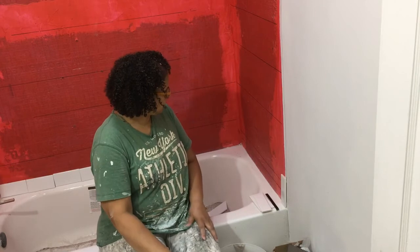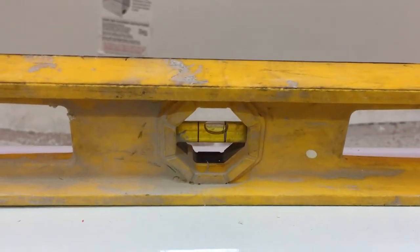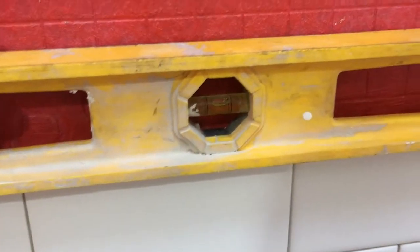Just a little space for expansion and contraction. I discovered that this tub is not level — you can see how it's pretty far off — so what I've had to do is start spacing out these grout lines from this end and kind of phasing that out towards the other end to try to bring the tile closer to level. It's getting a bit closer.